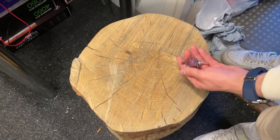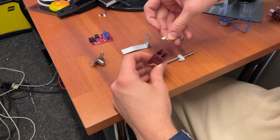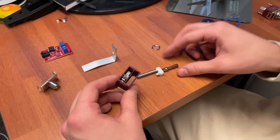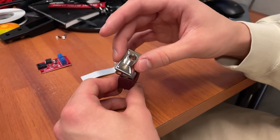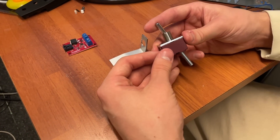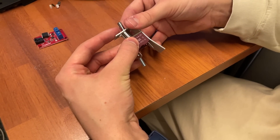Let's get everything prepped and ready for assembly. First you need to disassemble the switch like we have done and drill a little hole on it. Then assemble it back up like we show here. After the switch is all covered up and the screw is now sticking up from the back, you can put the aluminum piece together and attach the electromagnet to it, like shown here.